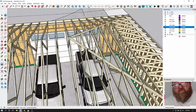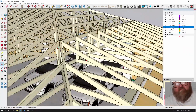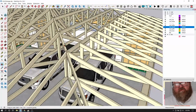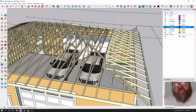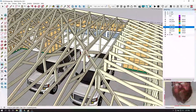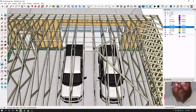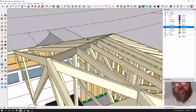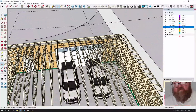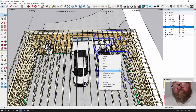You don't torque these screws down because the sheeting is actually coming up to kind of a point, and you don't want to torque your screws down like if you're putting a metal cap on. You just want to run it in and let it stop. Right when you get it snug, stop it. Because if you don't, these blocks are down just a little bit. They're not perfect. Nothing in framing is perfect. We can draw it near perfect, but in the real world, it doesn't exist.